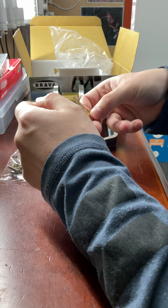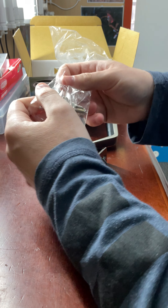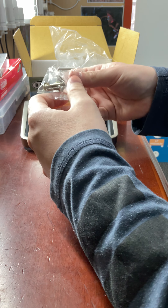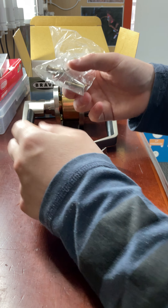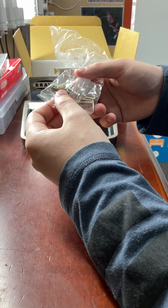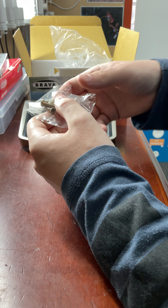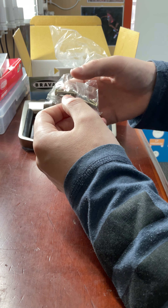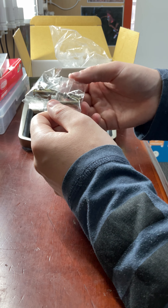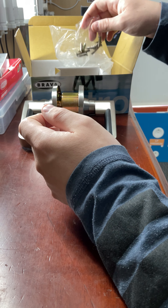This tool here is used to remove the handles — I'll show you that. Inside you have all your screws. You've got four screws with a wood thread and a metal thread — two will be for the latch and two for the striker plate. You've got two long metal thread screws to screw the lock onto the door, and then two more wood screws for going underneath the bevel. There are two other little parts in there but those are pretty much irrelevant — most people don't use them.